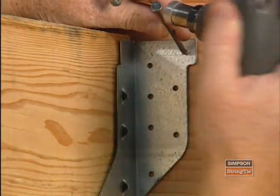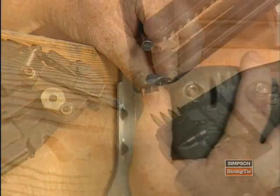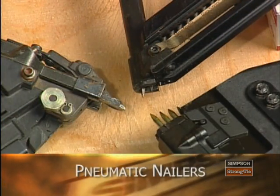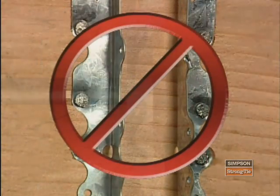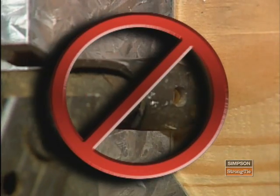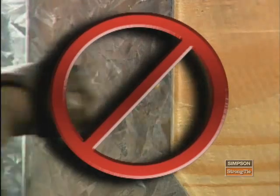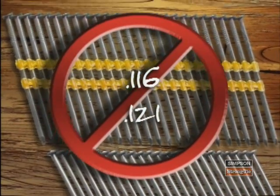Now that we're aware of the importance of using the right nail for each connector, let's talk about installing those nails. The metal claw hammer is still the tool of choice, but palm nailers can also be used and are a great way of reducing installation time when used with the correct bag nails. Some pneumatic nailers can also be used, provided they have nail hole locating mechanisms and they use the correct nail for the connection. Do not overdrive the nails — the nail head should be seated flush with the steel. Most standard framing nailers cannot locate holes and therefore should not be used to install nails into connectors. Furthermore, since most collated nails for standard framing nailers are undersized, they should not be used to install connectors.